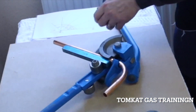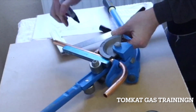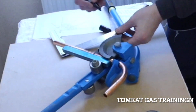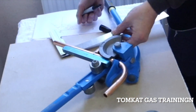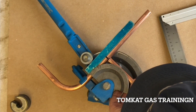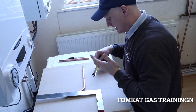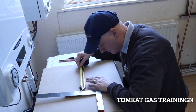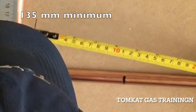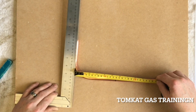Using the loose pipe method, I put the pipe in the center and use my square to mark the center point. That gives us the minimum center-to-center mark this pipe bender will produce. I've got my set square laid out and this is our center-to-center measurement. The minimum center-to-center measurement I can make with this setup is 135mm.